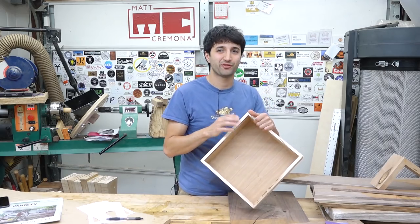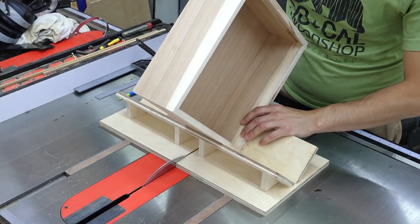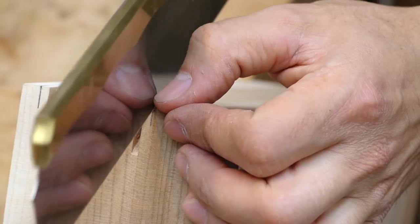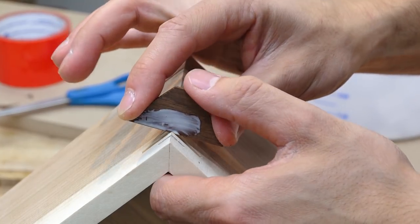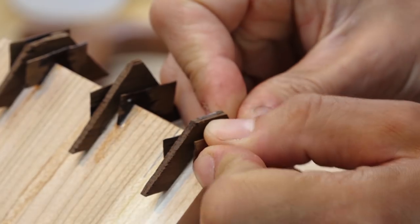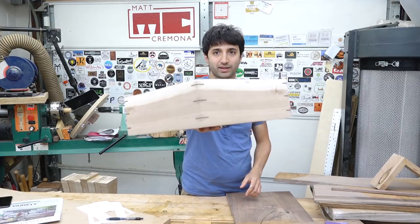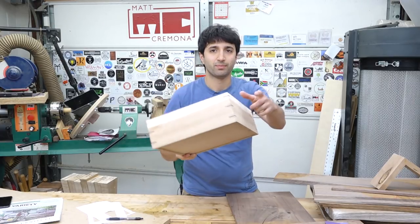In the shop this week, I've been shooting a few of the Spice Box lessons. I did the video on making a spline sled for cutting the spline slots at the table saw, and I also shot the video on making ornamental splines. For the splines on the box, I used both a table saw cut as well as a hand saw cut. For the table saw spline, I used a thin kerf blade, so I have a relatively fine spline for the larger size. Then I used a dovetail saw to cut the splines that go around the larger ones. That leaves me with a pretty cool look — three large ones and smaller ones in between.